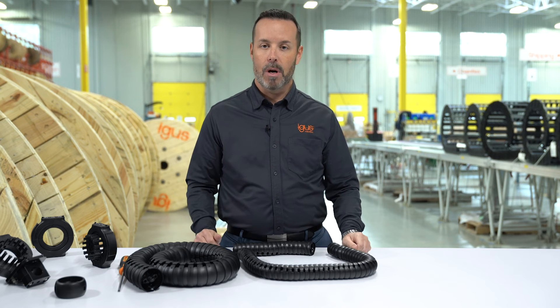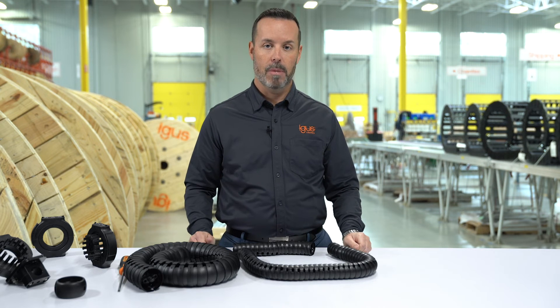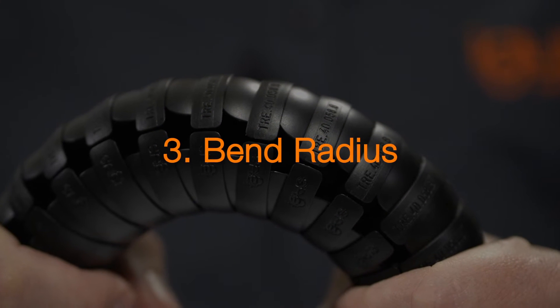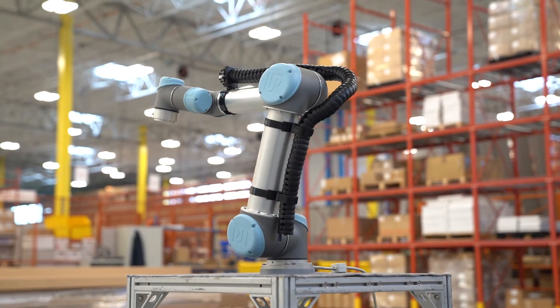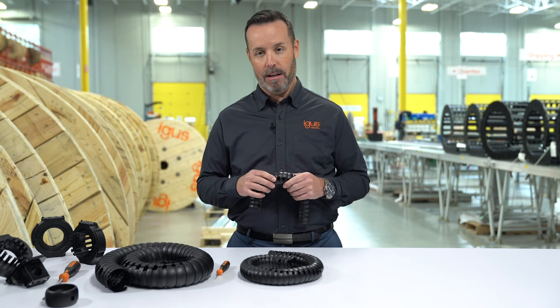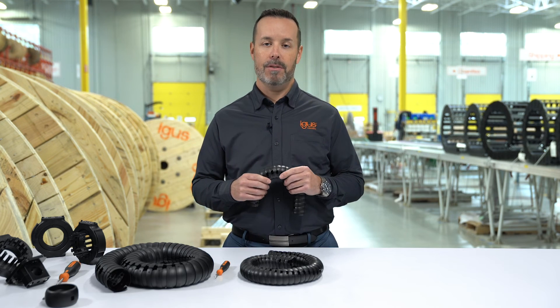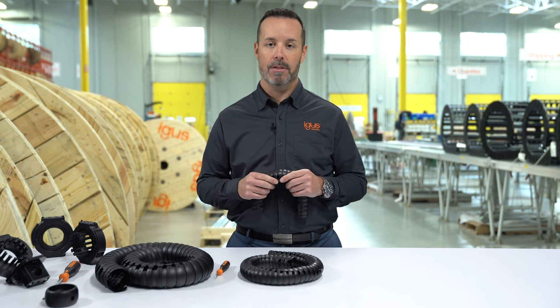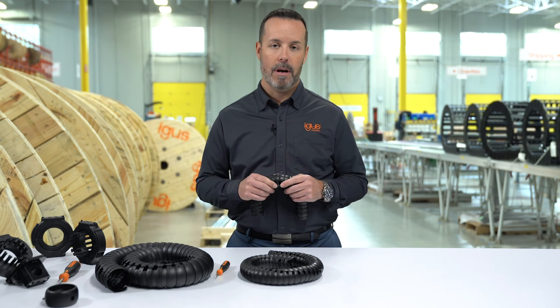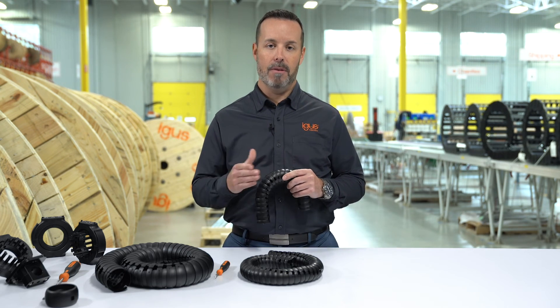You can reduce downtime on breakage of the actual cable management by over 75%. The third feature is bend radius. If you've used an IGUS cable carrier in the past, each one comes with a bend radius built into it. TriFlex R is no different — each size has a defined bend radius. This is important because your cables have a minimum bend radius and we don't want to violate that. TriFlex R is the only product in the marketplace that has bend radius protection.